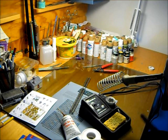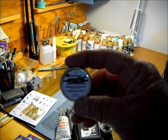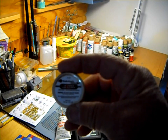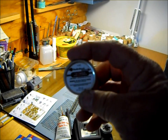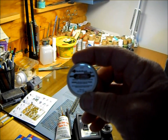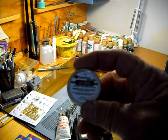Next thing I'm going to get into is tinning the tip of your soldering iron and using the right size tip for the job. Okay, this is the tinning agent that I use. It's also a Radio Shack product, the 64020 tip tinner and cleaner. I use it on and off quite frequently. If I go out to the grinder and sharpen up some tips to make them a little bit finer once they wear down, I will tin it with this, and I'll show you here.